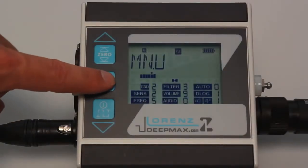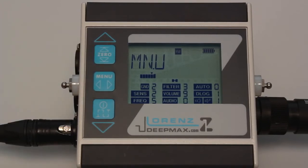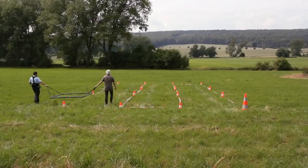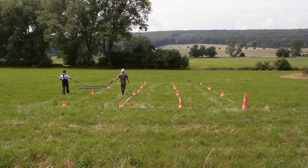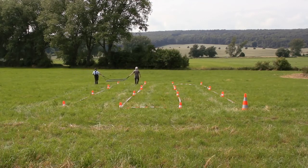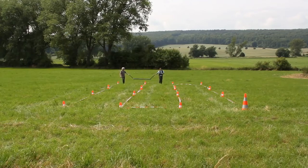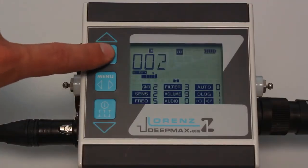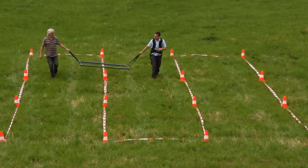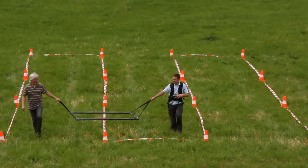D log one will appear on the display. The following functions are displayed: meter, track, field and heading information. To start with a new field press zero once and start walking immediately along the first track. Press zero repeatedly at the end of the first track in order to store data. When starting with the next track work the same way while walking backwards, not forgetting to press zero at the beginning and end of each track. Always try to walk in a straight line and at constant speed and to press zero over the start and stop lines.